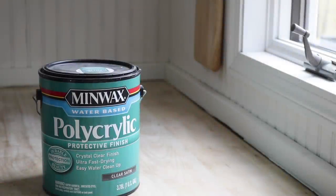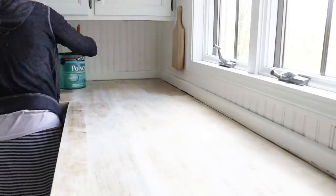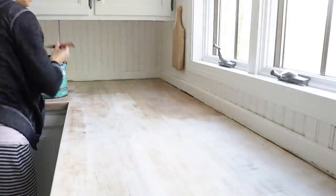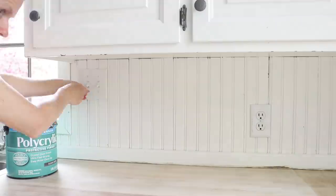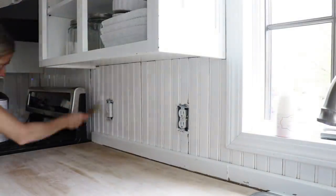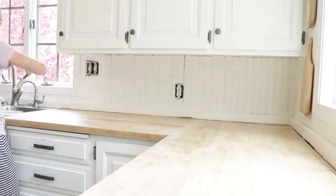Because I am loving the natural color of this countertop, I will just be applying a coat or two of polycrylic — maybe two or three, I'm not quite sure yet. It is by Minwax and I've used it before in my videos. In this case I'm using the clear satin. I also decided to start painting the beadboard behind the counter. I am using a Do-it-Best brand paint, just off-the-shelf — it's called Bright White and the sheen is satin.